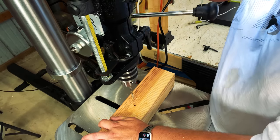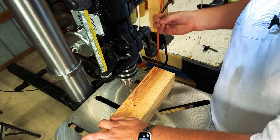And you probably saw from that, the drill press actually stops once it gets to that 3/4 inch. Now, I'm pretty sure that my camera didn't pick it out, but once we start that drilling process, it automatically adjusts the load of the drill press. There's also an audible beep that allows you to know how close you are to that endpoint. As you get closer to the 3/4 inch, it begins to beep quicker and quicker.